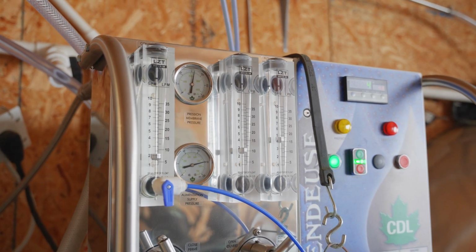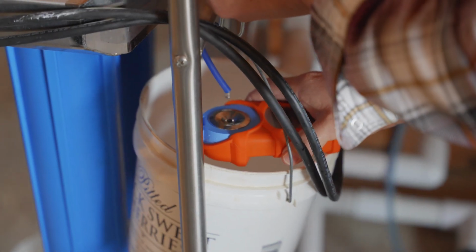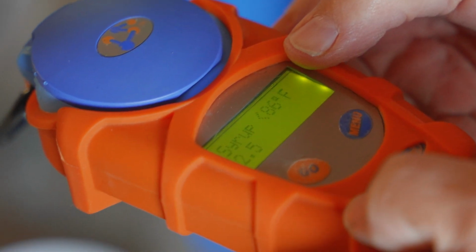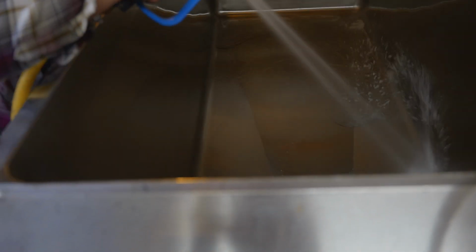So next we have the reverse osmosis machine. We just call it an RO for short, and just think of it as a big filter. The water goes right through, and the sugar molecules are held back, and the water is now called permeate, and we use it for washing. And the concentrate, which is the sugar held back, we now boil it.